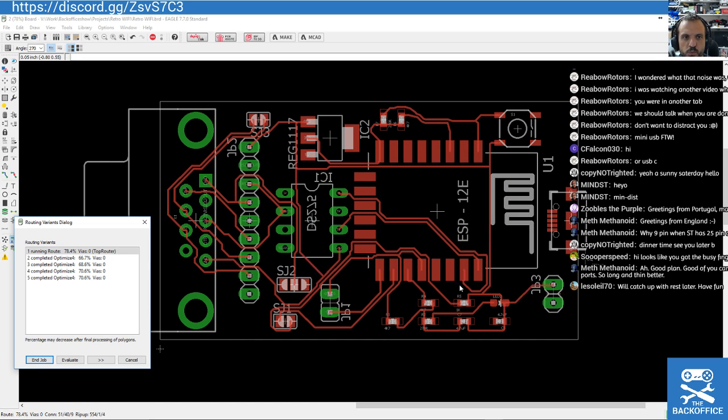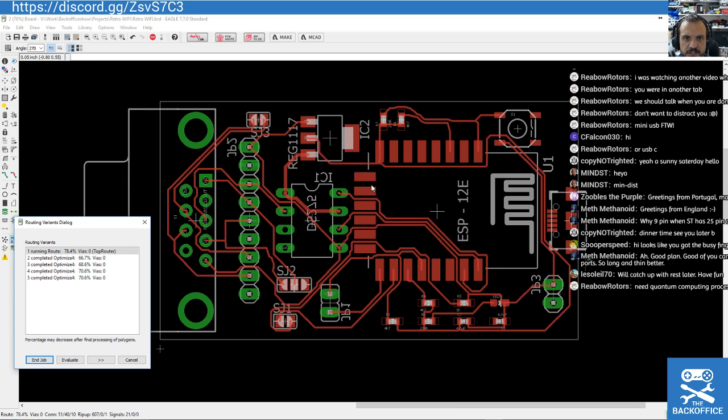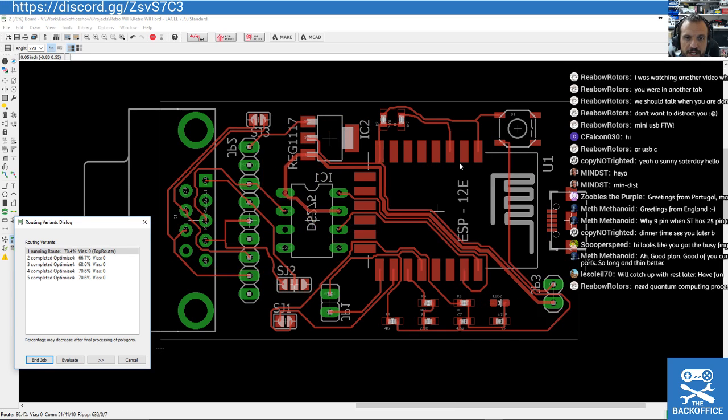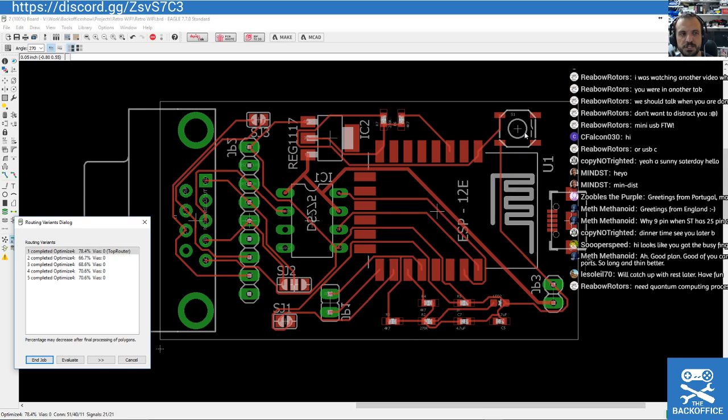In operation as well, if I don't hook up the reset switch, to actually get this to work with my computer right away, I can just put the module down, IC1, the DS275 chip, and the serial I/O, and that should be it. Maybe something for power. I don't really need to hook up any of these resistors or the power switch, so that's pretty neat too.